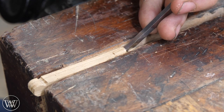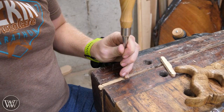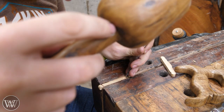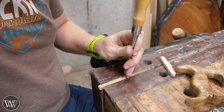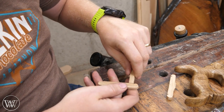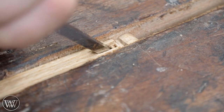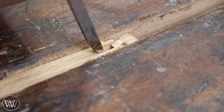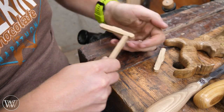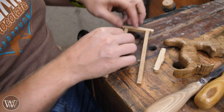On the other ends of the two end pieces, we need to create the mortise. Cutting a sixteenth-inch-wide mortise is a lot more difficult than it sounds — you're taking off very little pieces. I put it in the vise so I could chop out and then pare both sides. It took more work than I expected to get a nice clean mortise, but eventually we did. We made sure all four corners fit nicely, and we've got ourselves a frame for the frame saw.